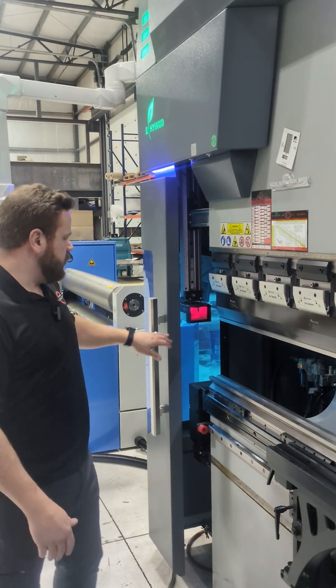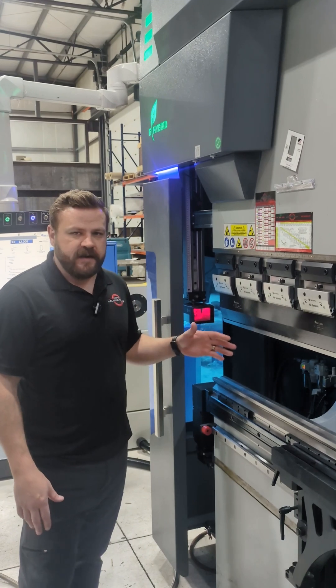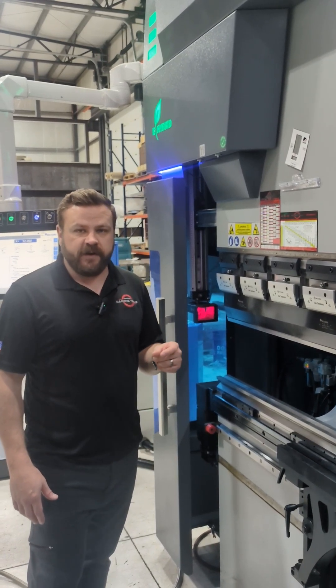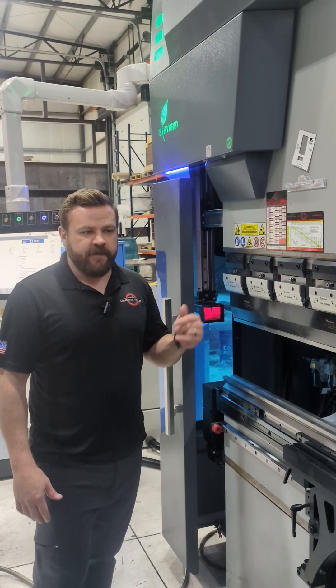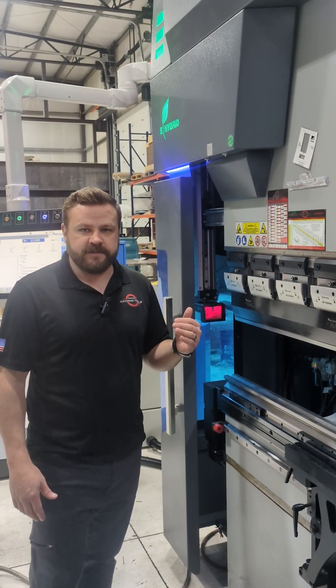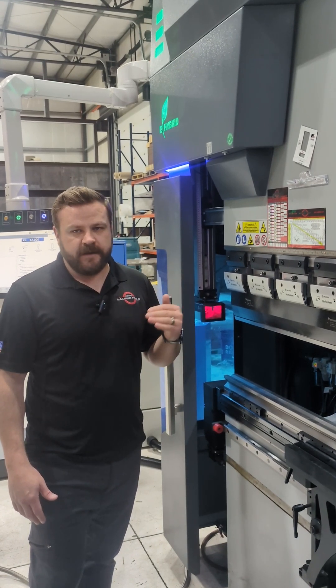It's good to go through and wipe these off with a nice clean microfiber towel. I wouldn't use any liquids on them — just wipe them off and get the dust off. Another big consideration is to make sure your material thickness is correct. If it comes down and expects to see, say, 11 gauge and you have something else put in, it's going to trip that system and throw a fit because it's seeing something before it should.